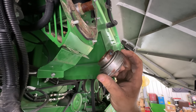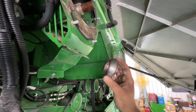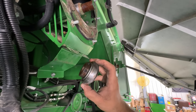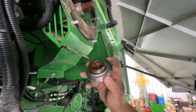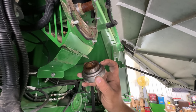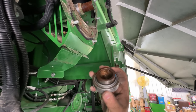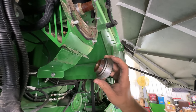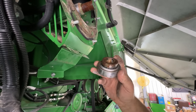So we don't normally have bearings like this. This is the first 700 series I've seen use this style bearing. But what I might do next time is take these set screws out, and since I'm going to replace the bearing anyway, drill through this hole and drill out that little dimple in the shaft just a little bit. Then maybe you can get the bearing on and off a lot easier. I don't know what you guys think. Comment below if you've ever run into these style bearings and what tips and tricks you have. But that's what I think.